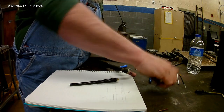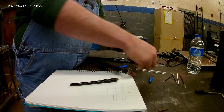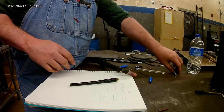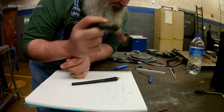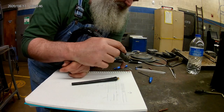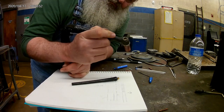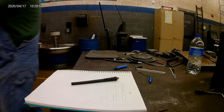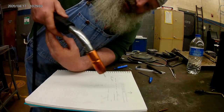That doesn't mean it's the only way to do it — you can still do it with just a TIG rig and a dry run. I tell my students that dry run is very important. You can build that manual dexterity whether it's with TIG, GMAW — I don't want the terminology police to come get me — or SMAW. You can build manual muscle control just holding that torch in your hand. Same thing just holding this MIG gun in my hand.